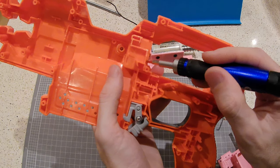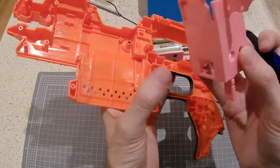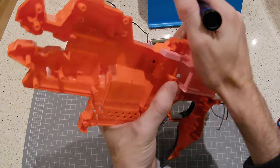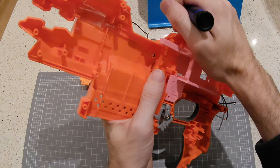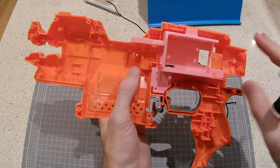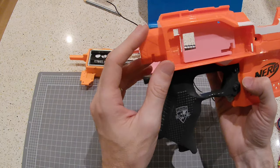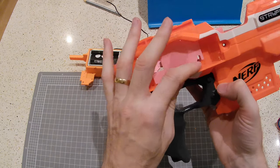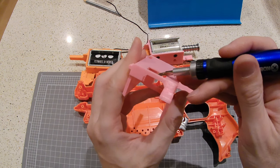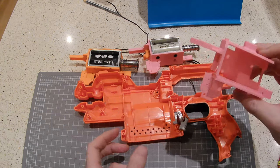What's important is we don't cut too far away from here, and we don't cut too much away either — this part here is sitting like this and just sort of sits down there. All the rest around here we're not going to change. Pop it around the other side — you can see the battery tray has been cleaned out, with a cutout in each side for the wires to go through. The actual wall thickness is about 1mm here, so you don't lose much of the battery tray area to the solenoid shell, but it holds it in place and keeps it reasonably strong and secure.